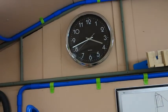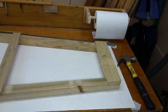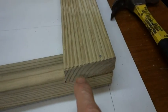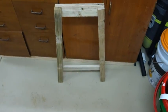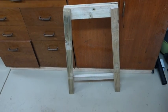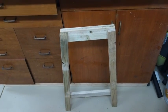Okay, so it's slow progress on the bar stools for the platform, because it's now 3:45, and all I've managed is one of these sides here, and it's not even screwed together. There it is. I've had to rebate this into there, and I've had to rebate the top into there, so that this will be one of the sides of the stool, with the legs splayed out slightly like that. To make it more stable, the legs are wider apart at the bottom. That complicates the whole process. So only another seven to go or whatever, because I'm going to do a mirror of that and then connect those. See you later.